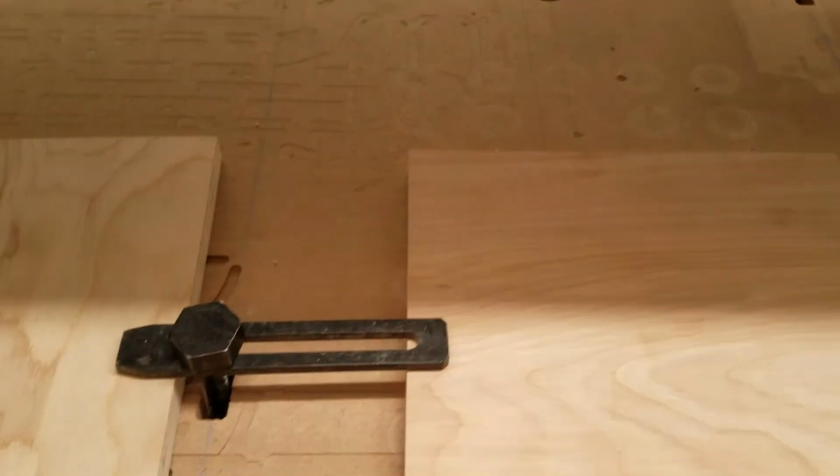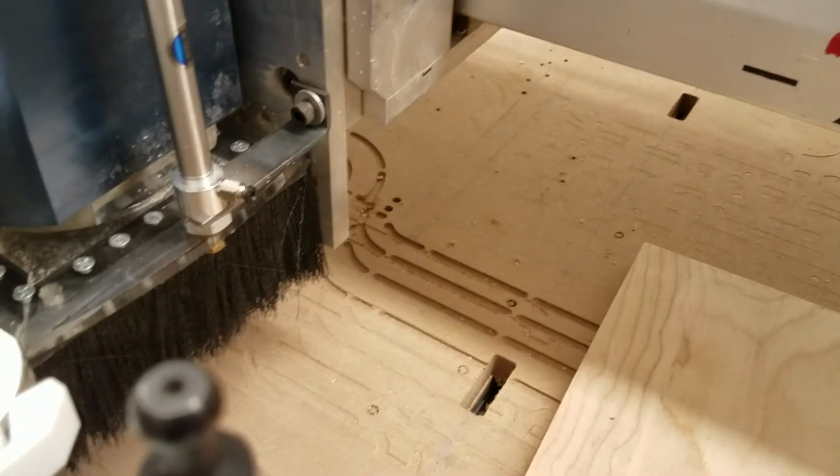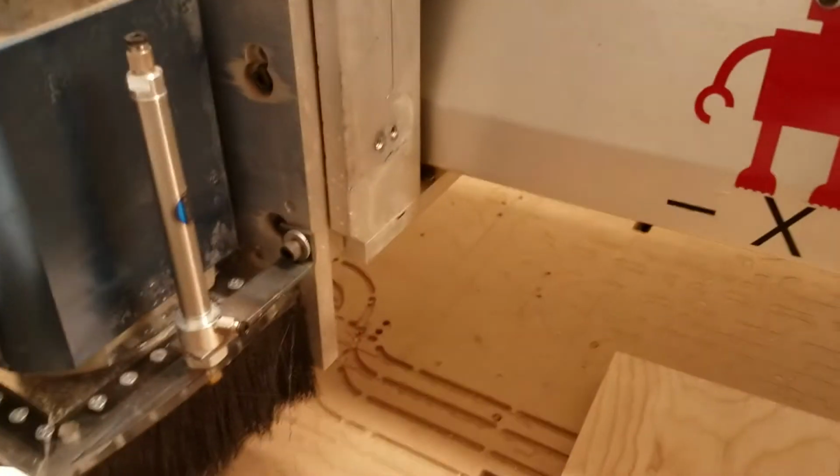So now we're going to do the other axes, and I'm going to do those up on the top surface. Because we're doing them individually, it doesn't really care where the Z is. So we're going to bring Z up. I'm going to go back to continuous mode, so we're not moving by 5/1000 of an inch at a time.